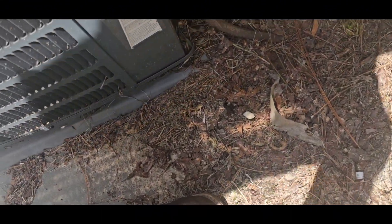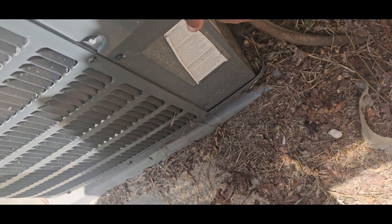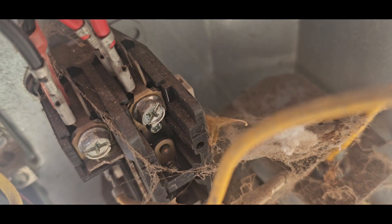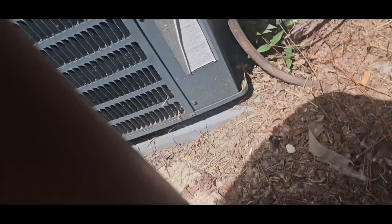Let me go ahead and take the panel off — I think the screws are on it. Yeah. God dang, for not having screws on this, put on there pretty tight. Took the panel off and it looks like the contactor is slammed in, but I don't think we're going to have voltage coming all the way through. Let me get my meter out, set up the tripod, see what I can show you guys.